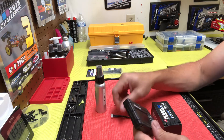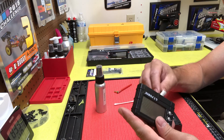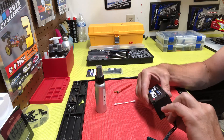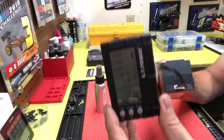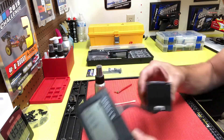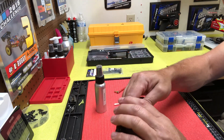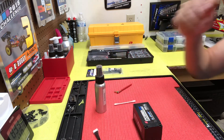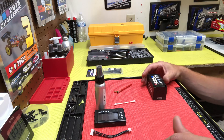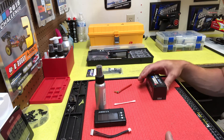Something like this tool — it's fairly cheap, around twenty dollars — comes in really handy. Primarily I use it to check packs quickly. Just plug in the balance port and you can see it's reading around 3.88 to 3.89 volts per cell. For storage you want between 3.8 and 3.9 volts, and you want all cells balanced as close as possible, like all at 3.85. Most chargers can show you this too.